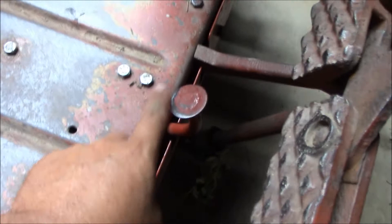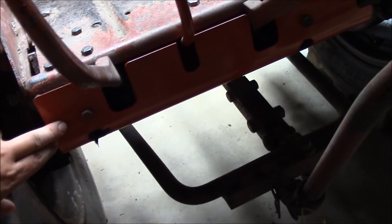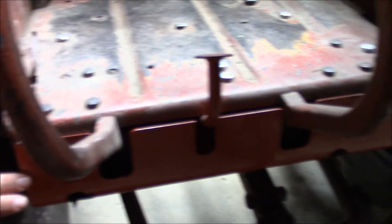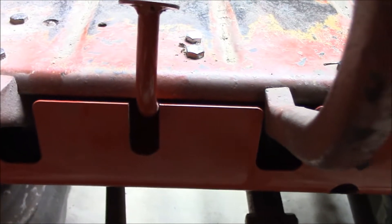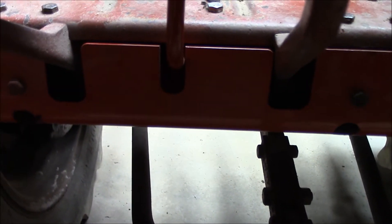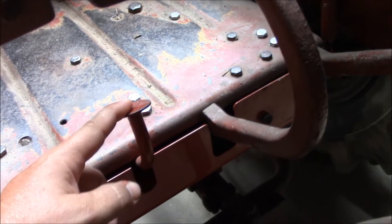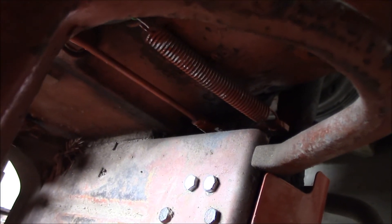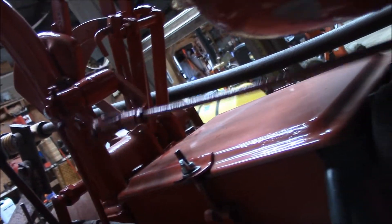The reason I did all that was I installed a new foot pedal, or foot throttle. I got a new brake cover — a shield cover here — and the one I got didn't have the hole cut out for it. So I cut my own hole out, and it's close on one side but it doesn't touch. It works. This here is off of an industrial Super A. How it works is it's got a little rod that runs across the bottom here, a little pin, and that's the spring that keeps tension on it. Runs up here to this little mechanism, and then that runs all the way back to the throttle there where it goes into the governor.